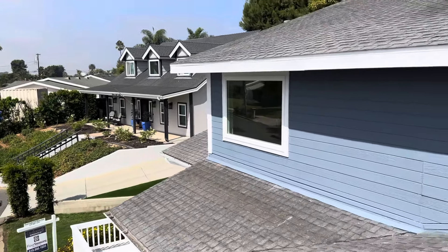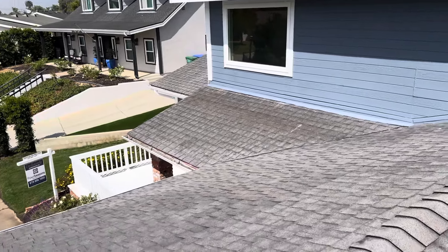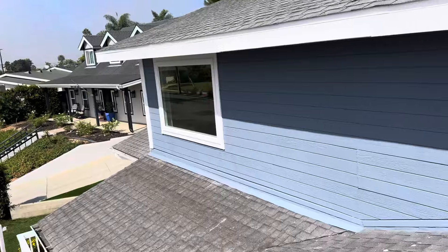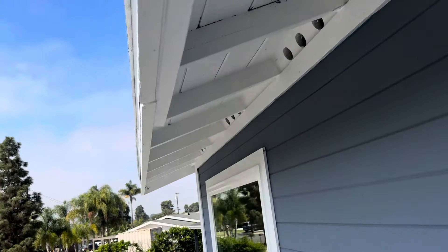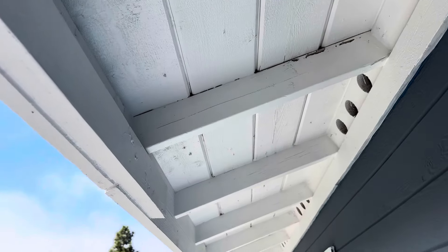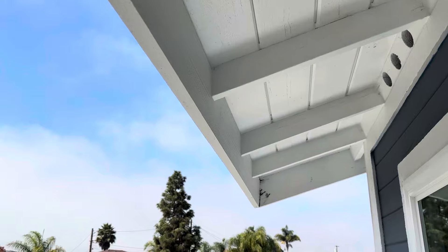This is Nick with Build Brothers Roofing at 3886 Alphie Lane out here in Carlsbad, starting my digital inspection on top of this asphalt shingle roof. We always like to start underneath the eaves of the house. The eaves of the home will consist of your fascia board, your rafter tails, and then your starter board. The reason why we like to start underneath the eave is that it gives us a really good idea about what kind of wood damage we can expect on this property.